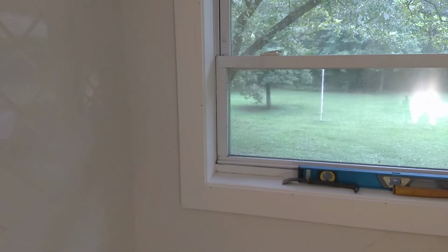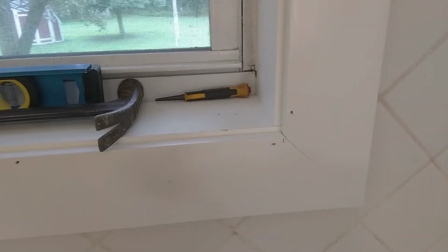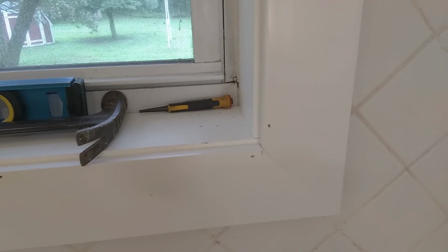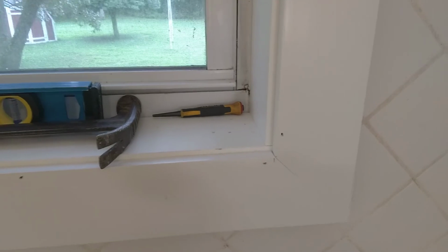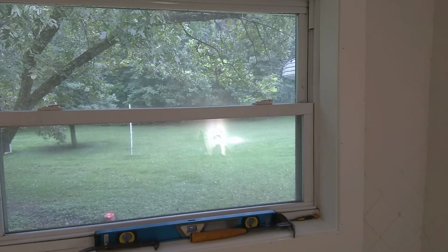Okay, I've got the window jammed and cased now. I think I'm going to wait to caulk and fill it until after lunch. I have to get this crayon to fill these spots. It fills them very well, and it doesn't require any painting. So I prefer to wait until I do that, and then I'll caulk everything to finish it.